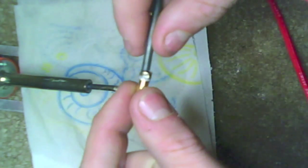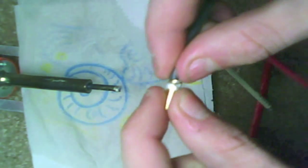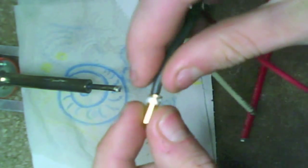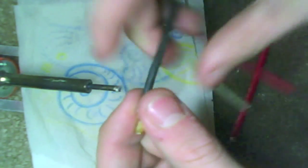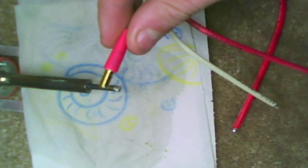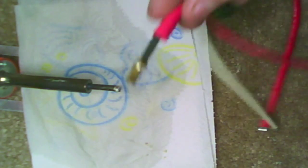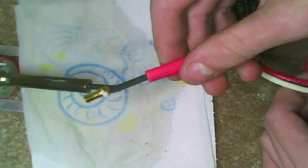Let it cool down a little bit. I like to really stress and try to bend the solder — if it doesn't bend, then you've got a really good connection. Afterwards just take your heat shrink, slide it up and line it up, and then melt it on down. Go ahead and do that to all three of your pins and then we are going to come back and do the Deans.